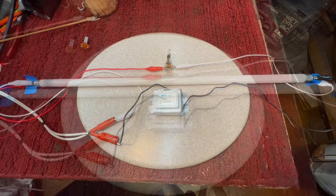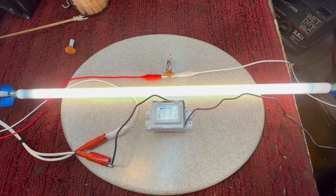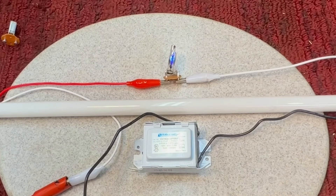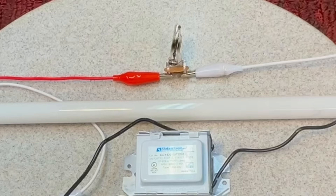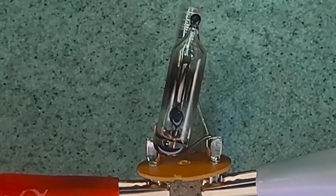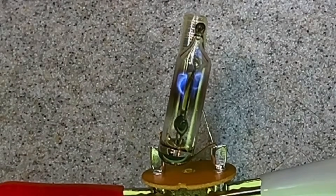Let's see what we have when we plug this in. Here we go. Did you see that happen? Keep an eye on the starter — that little capsule filled with argon gas. Watch what happens: it starts, then it sends that little jolt, lights up the tube, and then the starter goes into standby mode. Isn't that cool? That's something you never see. Let me zoom in so you can get a real good look. I'm going to shut it off and turn it on again. Look at that — that's the bimetallic strip heating up and starting that bulb. Isn't that terrific? How come we don't get to see this kind of stuff outside of a lamp?